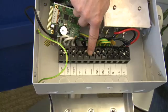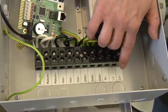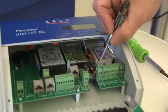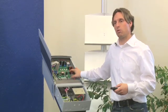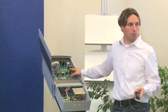For the inverter installation, you can see the terminals — grounds, L1, L2, and neutral. Using two cables connecting A and B, you run that cable to the card's A and B terminals. The Ethernet connection on the Prologue connects right there into the outlet. The inverter will always store cumulative data internally, so if service is disconnected, you can retrieve that data from the inverter and add it to the monitoring data.